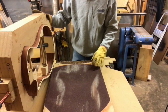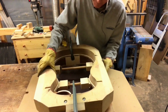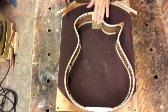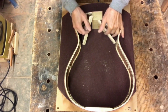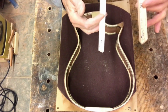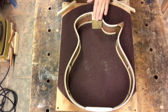And now back to the grind. For extra stability at the neck block, I place two flying braces, like so, which are patterned after these story sticks that have a good starting point for the complex angles, which are then sanded for a final fit.